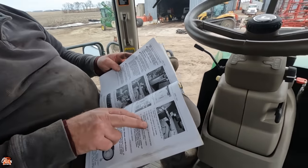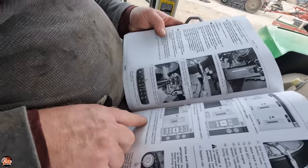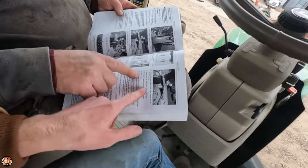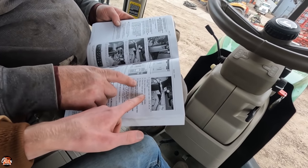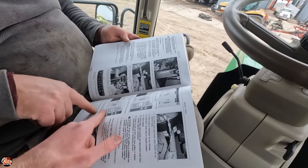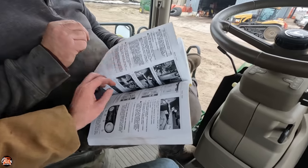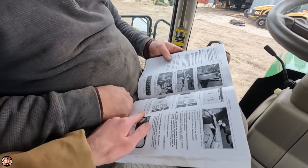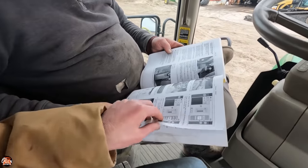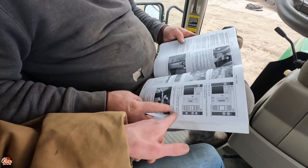They're still going back, but they're still detentioning. I hear it says push control lever forward to retract position, and then allow to detention. Yeah, so they're talking about detentioning. But we want to extend it, though, right? Yeah, so forward. If you push it forward, it says detention, and if you push it backwards, they do have the retract and extend. So if it says retract here to detention, we want to extend. So we want to pull the lever rearward to extend.